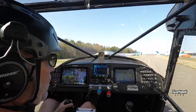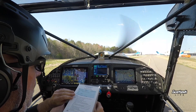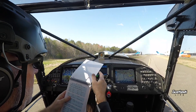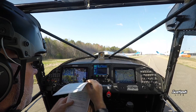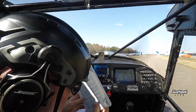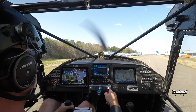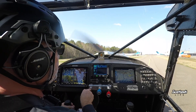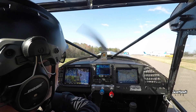I've got these EAA test cards we've been using, and some of this is for taxi testing: first engine start-up, fuel flow, engine run and taxi test, stabilized engine readings. All of this is really done with the EAA test cards to get ready for the first flight. I've requested the airworthiness inspection from the Charlotte FSDO. They're aware of it, I've got my paperwork in, but I'm not hearing anything back from them in terms of a date, so I'm waiting on that. Hopefully soon.